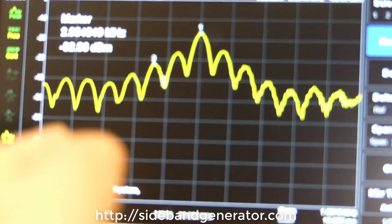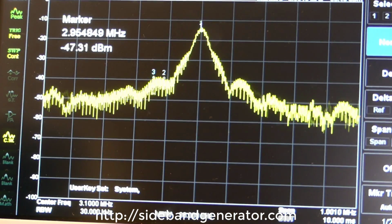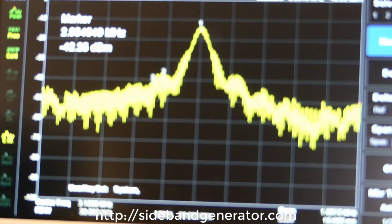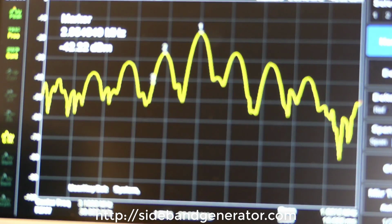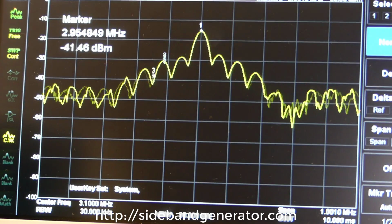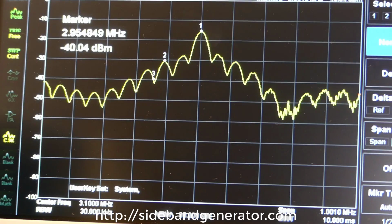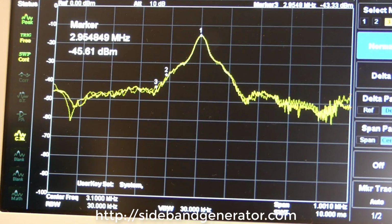So what this is doing is, you've got the fundamental, you're injecting these other lower frequencies, creating the sidebands which are going to hit all the different Rife frequencies. So I'm hitting two frequencies right there over and over on the third and the second, fourth, third, second, and even first sideband, it looks like, without having ever punched in those numbers. And as it's sliding up and down those peaks, those are all other frequencies that it's also hitting, even if Rife didn't know that they corresponded to anything. Okay? So that pretty much shows you that this is doing exactly what it's supposed to be doing.